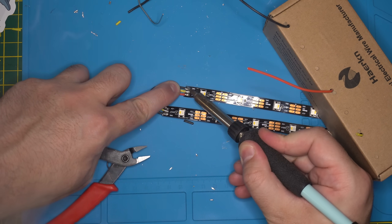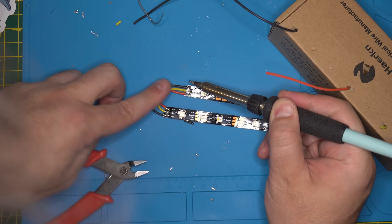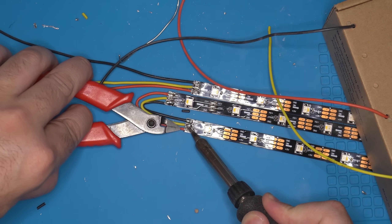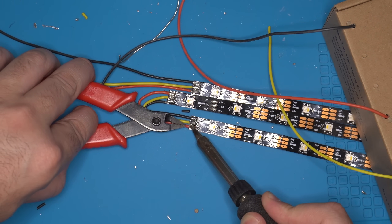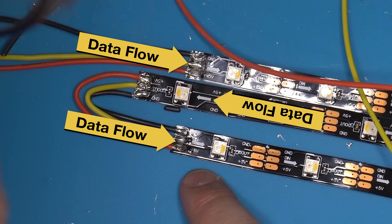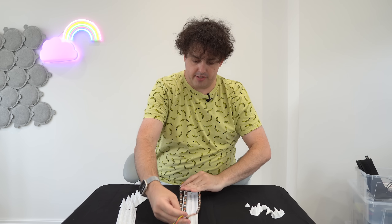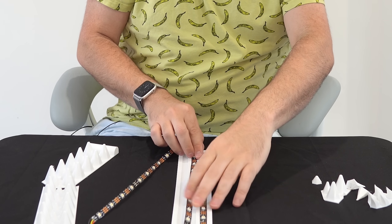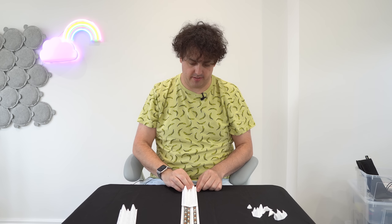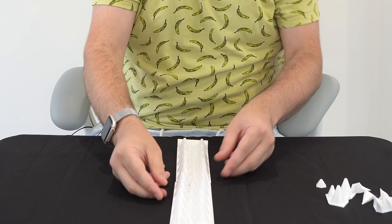With all of those LEDs cut out, it is now time to solder them together, which is quite tricky — especially if you're doing it in a rush and you can't find any helping hands to hold them down as you solder them. But I managed to get them in eventually. The thing to take care of when soldering these strips is the direction of the data running through them. You'll see the arrow on this model of strip, which shows the direction it has to flow through. And here they are soldered together, which means I can now place them in the backing. A little bit of glue will keep them together, and then I can put the top piece on.